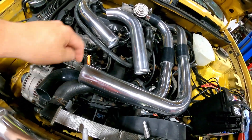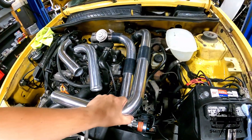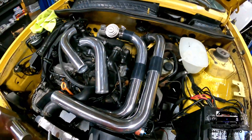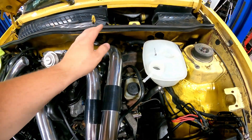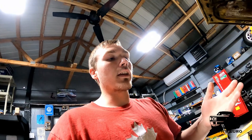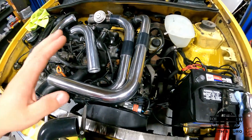Since I have this Mark 1 rad hose right there, I've already put a pipe across here and shut the hood — there seems to be enough clearance. The pipe coming out of the turbo is going to go up like this. These two pipes were part of a big U-bend from the kit — I cut both U's in half, and the first U is here, the second is here. I'll have to bead roll everything, but the silicone couplers are just holding things in place for now. I don't like having a lot of silicone couplers — it clutters everything up. I'm going to weld these together once I get my fitment.